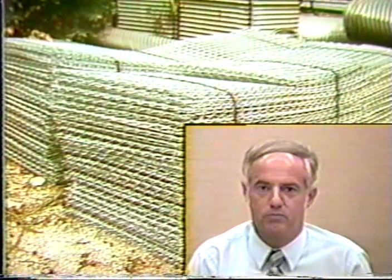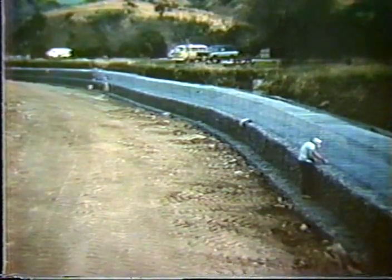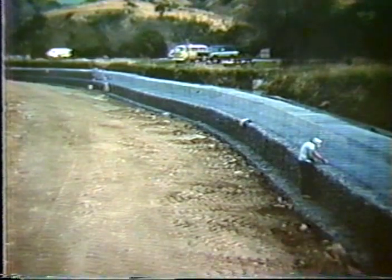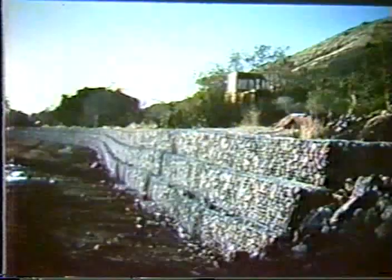The gabions come again folded to the project site, and then they are opened up just like cardboard boxes, and there are spiral connections to lace the corners of these baskets, and they can be used in just the same applications that I mentioned with the other twisted wire gabions. So there are alternates of basically, if you will, three major manufacturers of gabions on the market today.